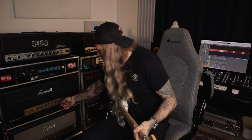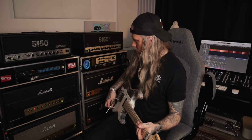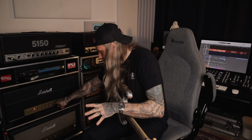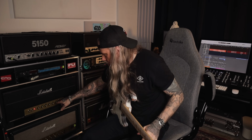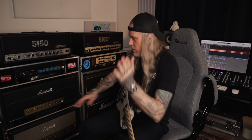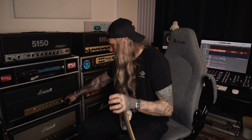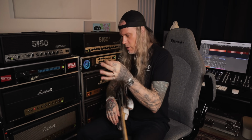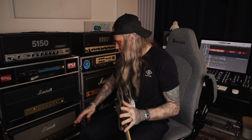Okay, and now bleeding that in. When you have the jumper cable, you're blending the channels with these two volumes, but when you don't, channel 2 still bleeds in there, because this input goes to the other half of the first preamp tube. They are in parallel, so they are not in series cascaded like on the JCM800. I think I've said this before, but the preamp tubes have two sides.